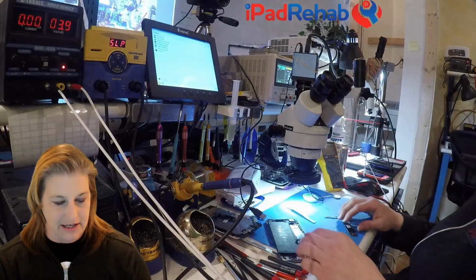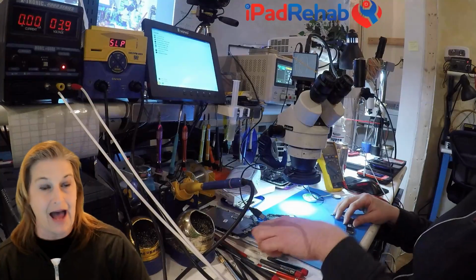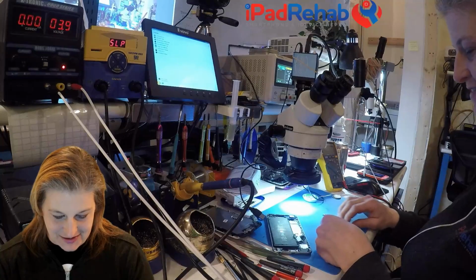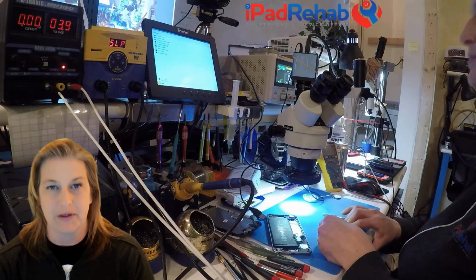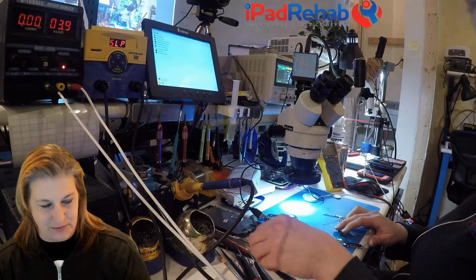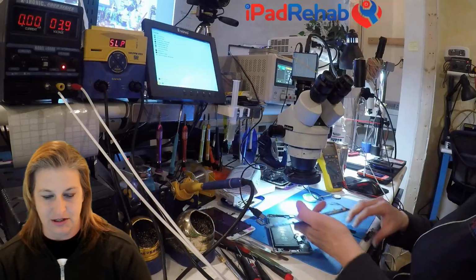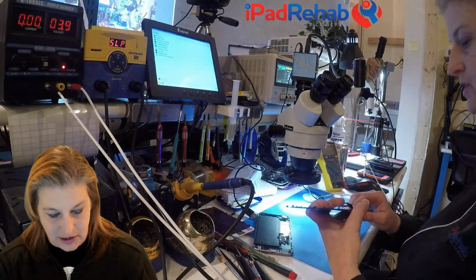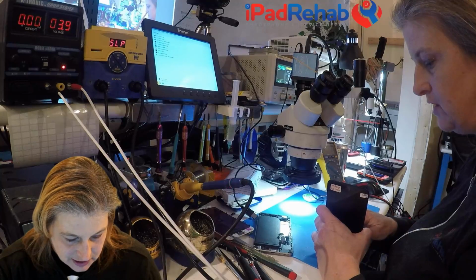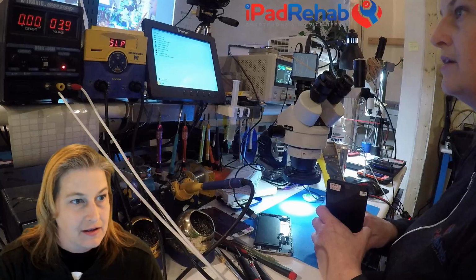I just got a new one today that I'm working on figuring out whether or not we can graph some DC power supply signatures for these terrible, awful iPhone 7s with their finicky boot looping problems, to see if we can kind of pinpoint baseband problems from audio IC problems by working up boot signatures, so kind of pattern recognition. So let's stick a dock and a screen on here, and then we're going to connect to DC power supply. And maybe this will be a short little video because there's nothing wrong with it. Maybe. Let's find out.